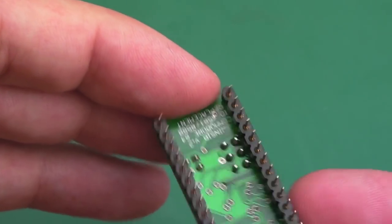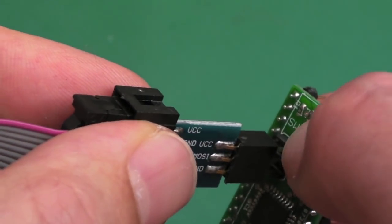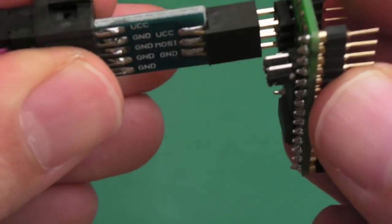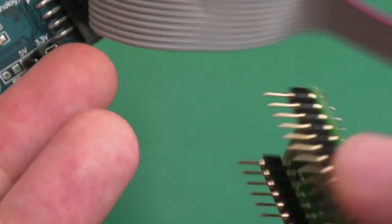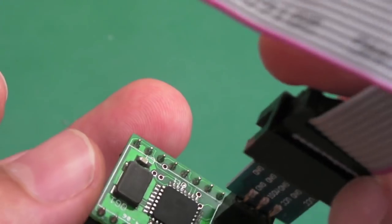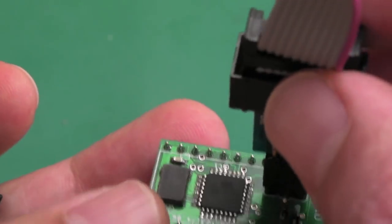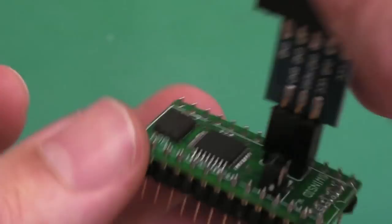The pin header is soldered in place. I should be able to connect this up so VCC is the top right corner and ground is the bottom right corner facing me. I can now plug this into the USB port and run the AVR programming software — hopefully it'll see the device and the fuses won't be set in a way that prevents reprogramming. This is my first time looking at these chips, so I'm hoping we can reprogram it. Alternatively, you could just order another ATmega88 and swap the chip — I can't imagine they'd be particularly expensive.